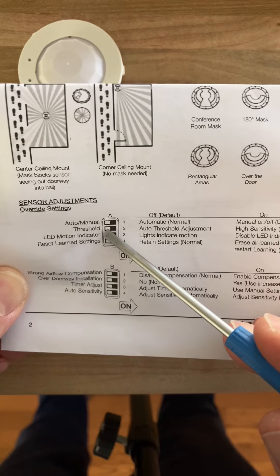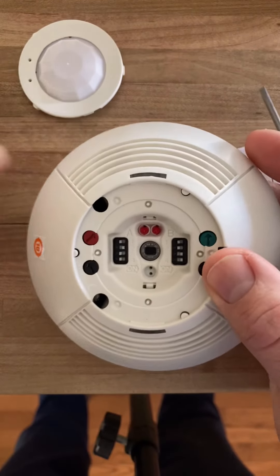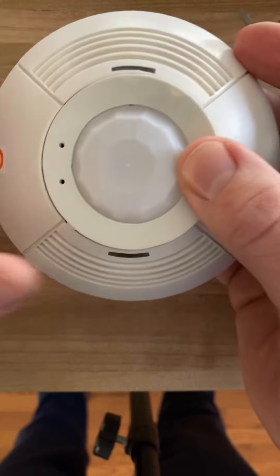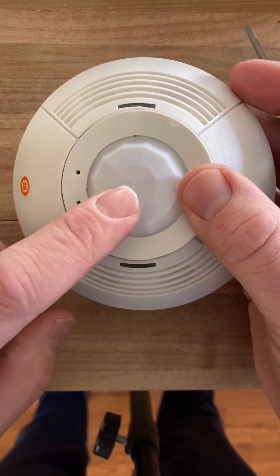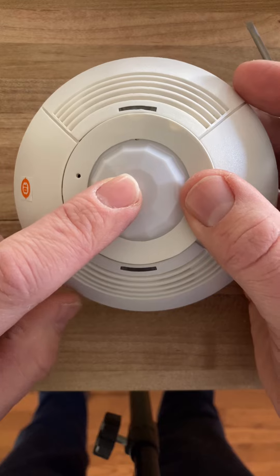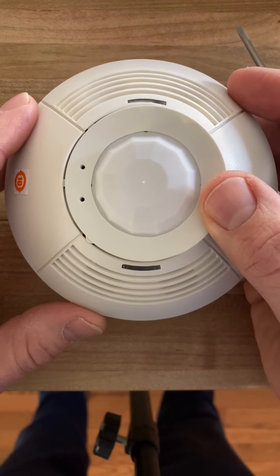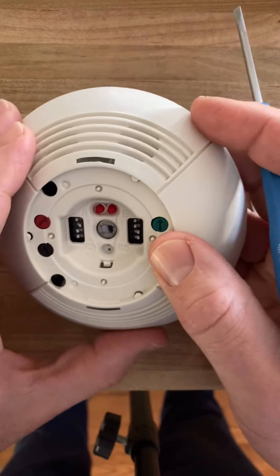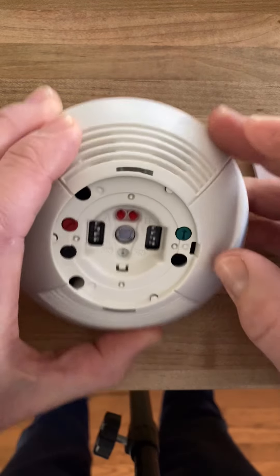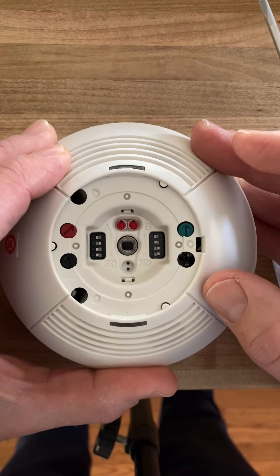The last one I adjust is this A2, which is regarding sensitivity. In the sensor's default setting, we have ultrasonic and passive infrared. For the lights to come on when you walk into a corridor or restroom, they have to sense with passive infrared first, and then it uses both technologies to keep the lights on. If you wanted it set up so that when you walked in the space the ultrasonic picked you up initially, that's where you would go ahead and turn that A2 setting on. What that means is either sensor technology could turn the lights on for you, giving you more adjustability with the sensor.